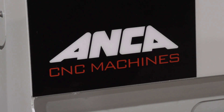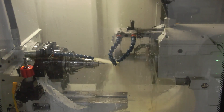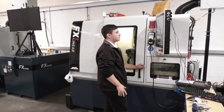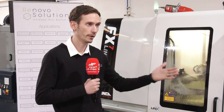What makes you different? There are many people that can re-grind a tool in the UK, but you're a little bit different. One of the key differences is that we've adopted an OEM mindset from the outset. We've invested in Industry 4.0 technology right from the start, employed very skilled operators, and adopted full OEM geometries, coatings, and methodology throughout the company. Here we're looking at an FX7 linear machine. The linear technology allows you to manufacture tooling quicker, more efficiently, but ultimately more accurately and with better surface finishes — which ultimately affects how the cutting edge of the tool cuts the material.